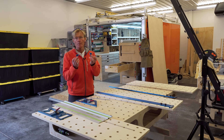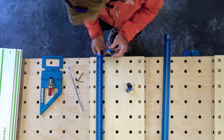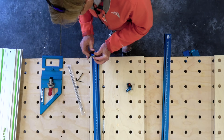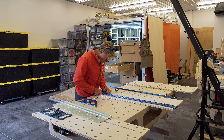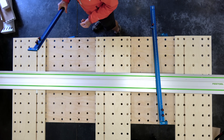The stops are identical except they're assembled in left and right. The guide that goes into the T-track on the rail is spring-loaded, so you loosen it, push in on it, and it slips right on the rail. And the pointer has no parallax error — you put it right on, and right where you set it, that's the cut you're going to get.